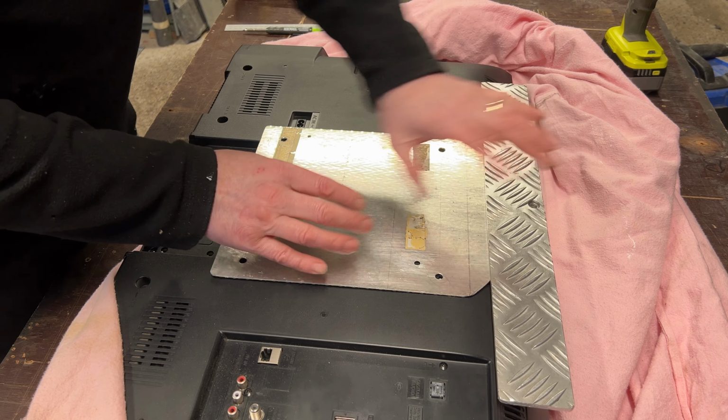That's all I wanted to do, just clean the top off. So I've got a lovely square edge there now, and on top of that there'll be that lip that'll come in and cover part of the telly surround up. So yeah, I'll do a few mitres now, 45 degrees, so we get on with that.